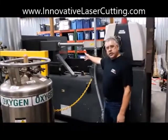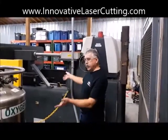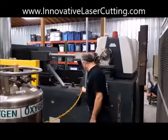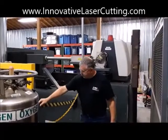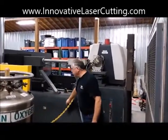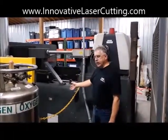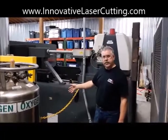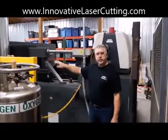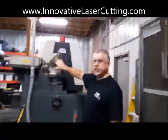On the opposite side of the laser there's a safety mat that stops all motion if you stand on it, but you don't have that back here. We use chains — the OEM safety port — so you can stretch it out. It does the same thing and keeps you from getting tangled up on the back side of the machine. The only people normally back here are maintenance folks doing beam alignment and working on all of this. And notice all these stickers — all these yellow stickers.